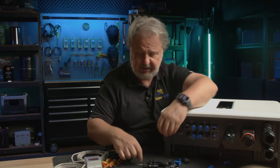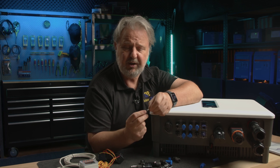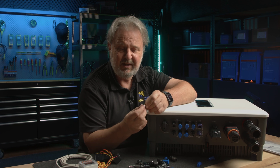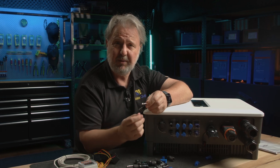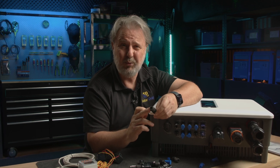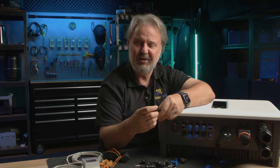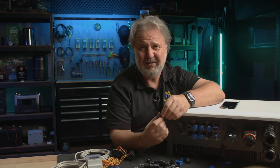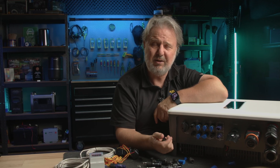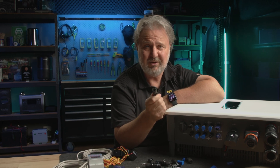The other hot tip is when you're actually crimping these, it's important that you use the right tool. There is a special tool for doing the figure-eight crimp, and you only need to strip just enough cable to go into the little U-bend on the end of the pin — it doesn't have to go right inside the pin itself. Once you've crimped it using the appropriate tool, you don't have to remove the mechanical restraint and waterproofing connector. Just poke it in until it goes click, and tighten this up really well so there is no chance of water getting past the rubber gland. If you can see daylight through it, you haven't tightened it up enough. Mismatched or incorrectly crimped and not properly sealed plug and sockets are one of the biggest failure points in PV array installation.